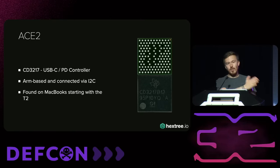The reason I'm telling you this is that we can do one very important thing: we can read the status of the chip. We can determine whether it's in application mode, boot mode, or DFU mode. If the chip fails to boot, we can measure it. If the chip successfully boots, we can also measure this. This will become important later.